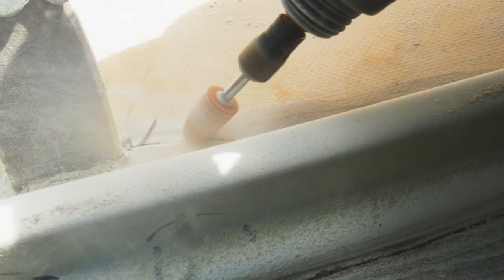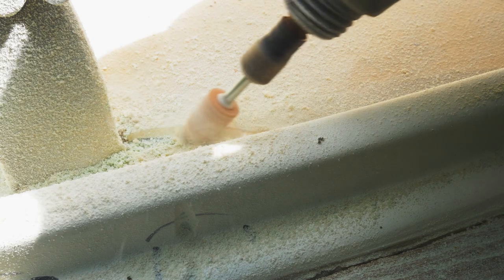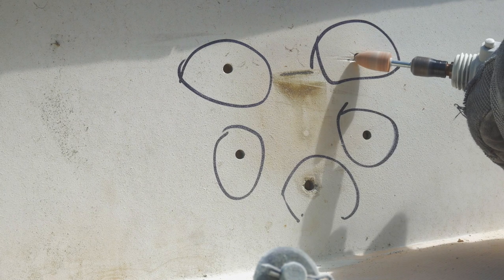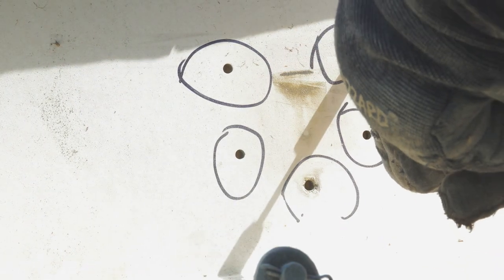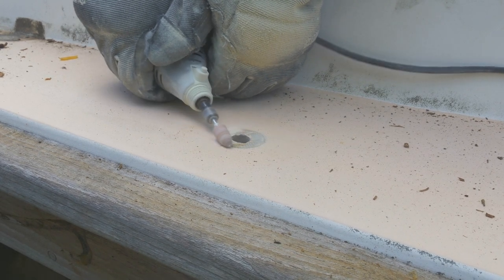The area around the chain plates took a little bit more, so I'm going to my larger grinding stone. After digging down into this, I started seeing that this was way more of a problem than just a spider crack. Even if you don't have the problem I did, you definitely want to go down through the gel coat and a little bit into the fiberglass. If you see the crack opens up even more and goes deeper, keep going down until you can get some decent fiberglass to grab on to. For areas like the old navigation light holes, I start to work into the hole, open it up a bit, then move at an angle to create a tapered shape — kind of like a morning glory or the bell on a trumpet. This gives the fairing compound a much better surface to bond to rather than just a straight hole, and it'll keep it from ever popping out.